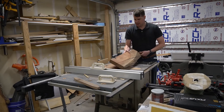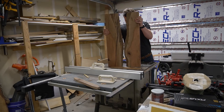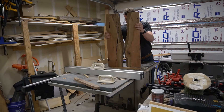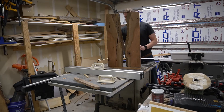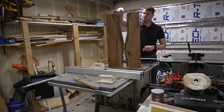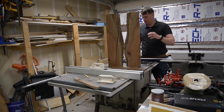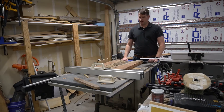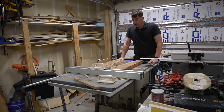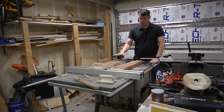It'll be a nice little table. I still need to make a form for it, but once the form is made it's going to be something like that — 30 inches long and about 16 or 17 inches wide. I've never done epoxy before. You can see there's some really big cracks in it, and I worry about bubbles, so I want to do very small layers to get those cracks filled in. It might go with clear epoxy or some kind of dye — it depends what the wife wants and where we're going to put it. The epoxy is on its way and I just need to get some more melamine to make the form. I'm excited to try this out.